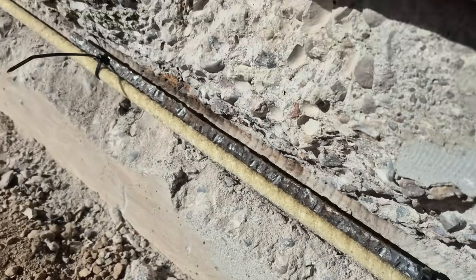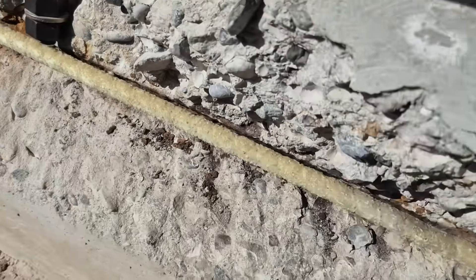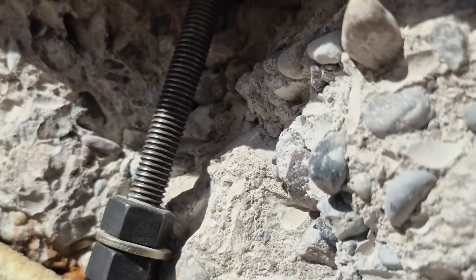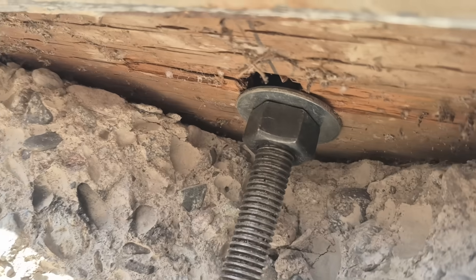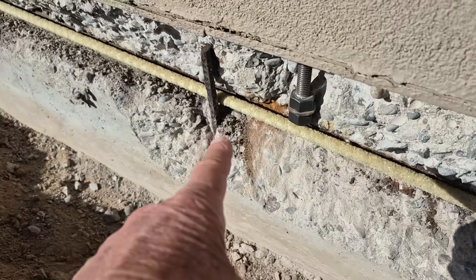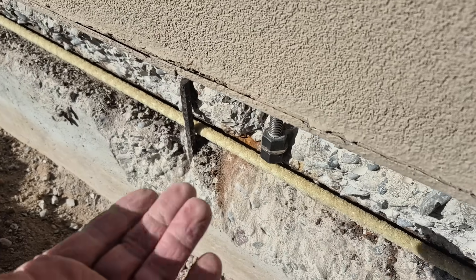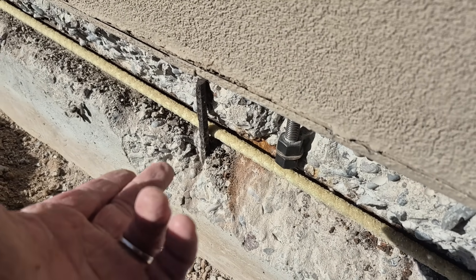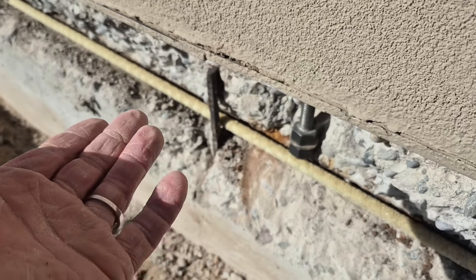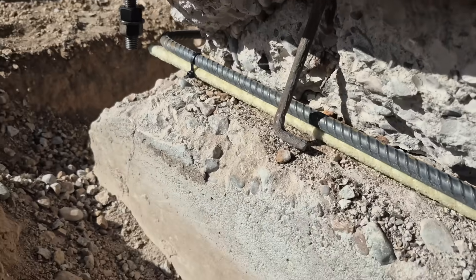We're also installing this J-bolt — removal and replacement of the J-bolt — and this is the new knife anchor installation here. I want to talk about this vertical rebar that the original concrete finishers put in the ground and then tied the rebar to it. That grounded it and is likely one of the causes of the electrolysis in the steel, causing the corrosion.